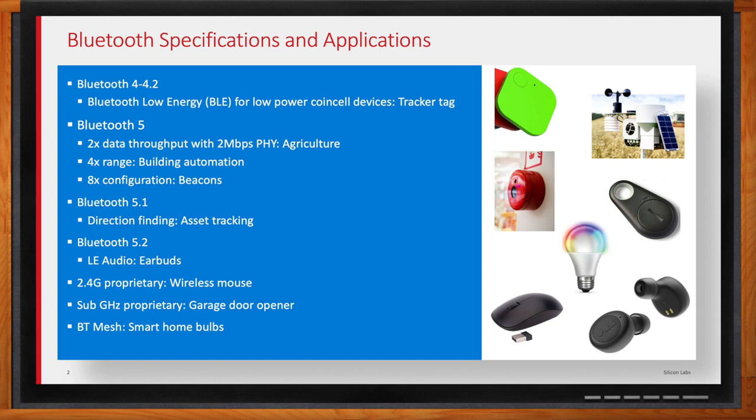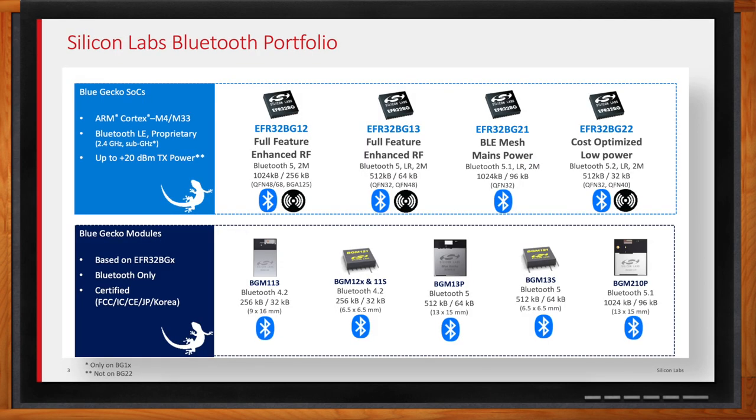So if I'm looking to get started on my own Bluetooth design, what kind of solutions does Silicon Labs offer? We have two big types of solutions. One is the easier gateway starting point, which would be the modules. The others are more embedded intensive solutions — the SOCs or system-on-chip. The modules are pre-certified, you have all the BOM components needed to set up a connection. These are great for low-volume applications or if you have limited development time — you can just bolt this on. It's very easy to get started, with a really easy-to-use API.